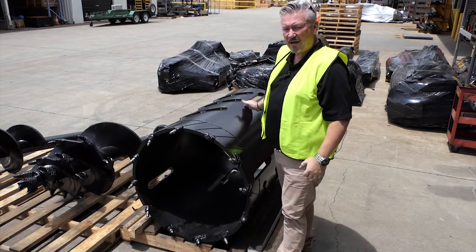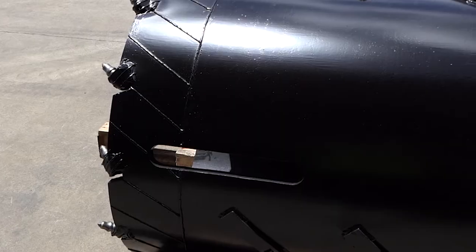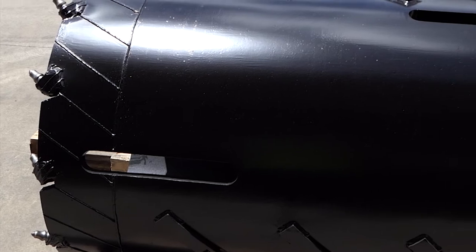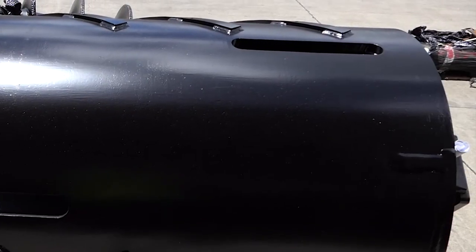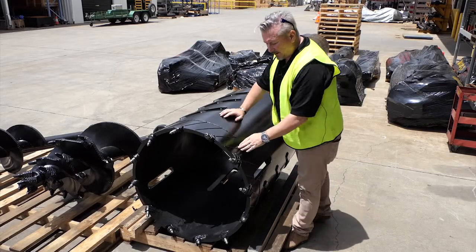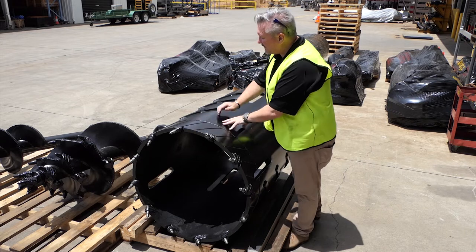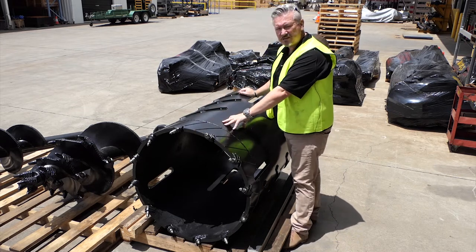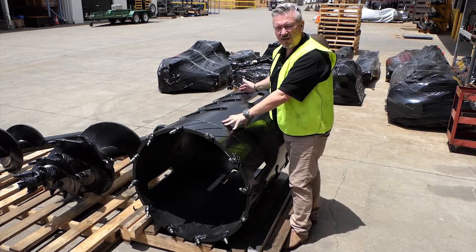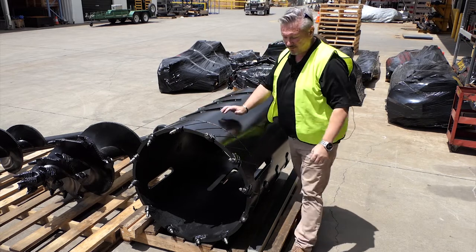If your slug does come out and it's inside here, we've put some nice cut-outs at various heights so that you can put a rock hammer in there, a crowbar, whatever it is to drive that rock out. We run hard facing on the business end of the barrel; all around the teeth you've got hard facing, and then we've got some clearing fins which help alleviate any of that spoil from sitting in and around the teeth, causing those teeth to wear out.